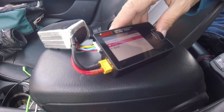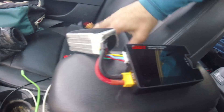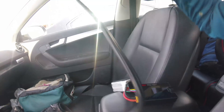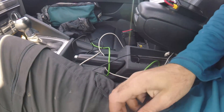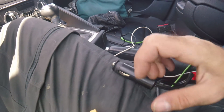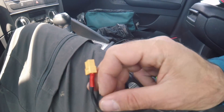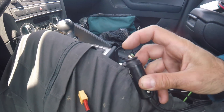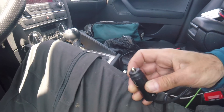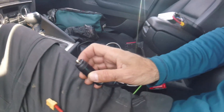All you need is to make yourself one of these cables — it's just a car lighter plug on one end and an XT60 on the other. You have to make sure the positive is wired correctly — this to this. And that's it. Hope this is useful, see you next time.